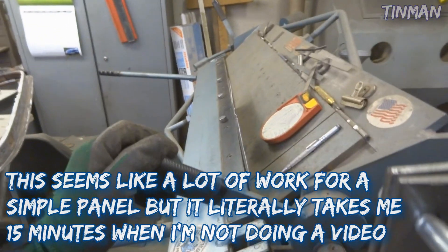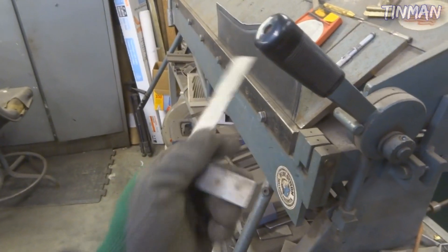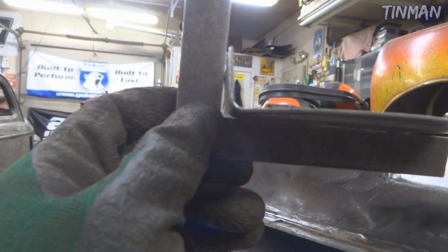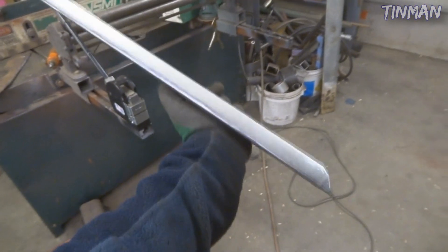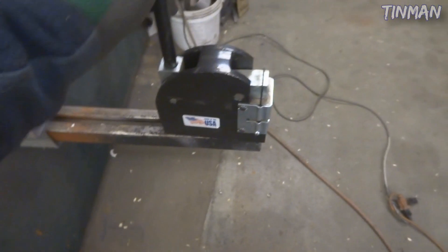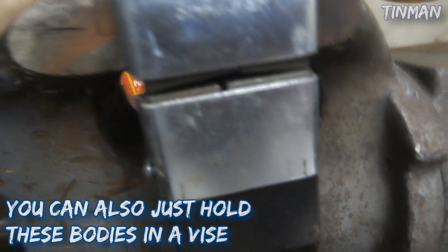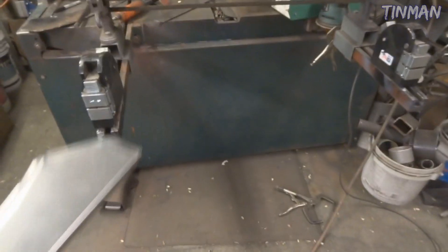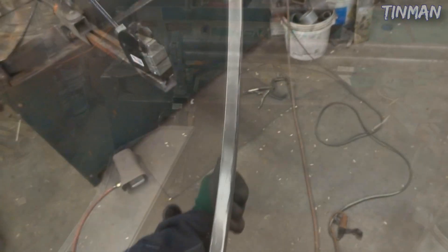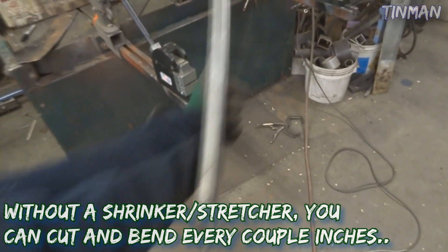I start off at a high angle and it needs a little bit more. I use a standard square to compare it - you can see it's under bent so it needs to be bent just slightly more, maybe a degree or two. As mentioned, once you bend this piece it's going to be back close to straight. What you're going to have to do is shrink this flange so it in turn sucks in tighter and gives you that radius back. I have a shrinker I ordered from Mittler Bros, just thrown on the end of my shear arm. I gave this a few slight bumps on the shrinker - probably about 12 of them, just very slight - and it gives it a nice clean radius.